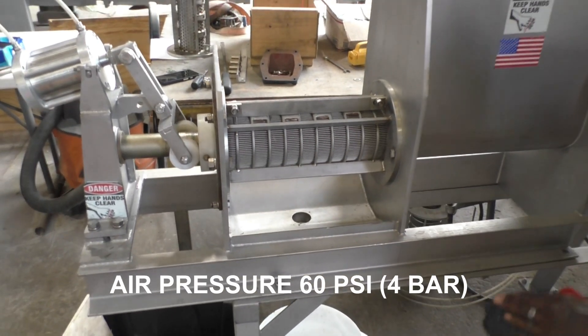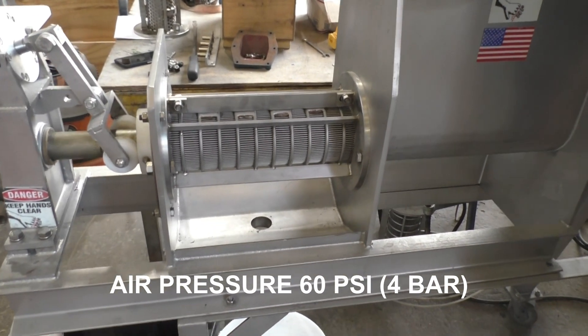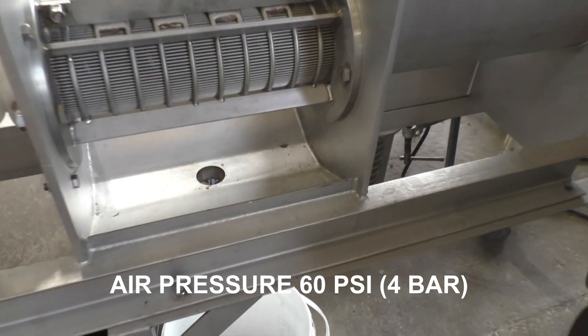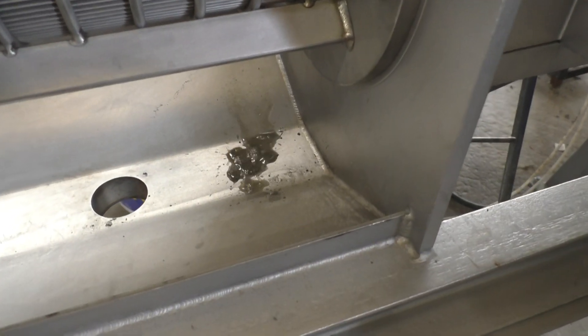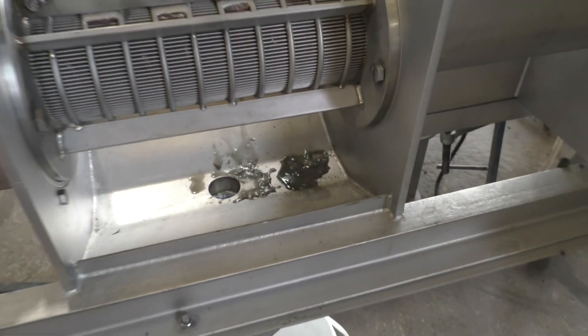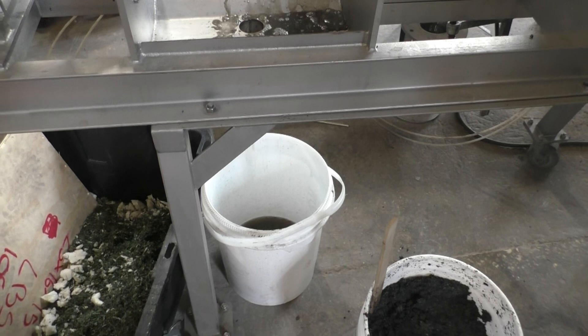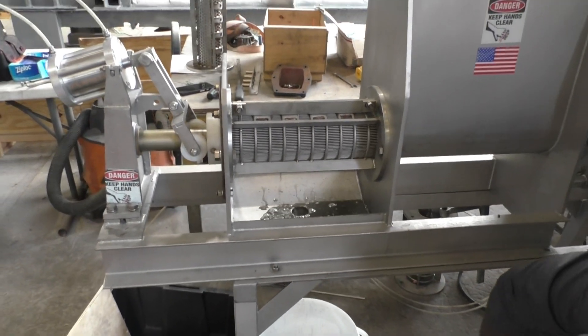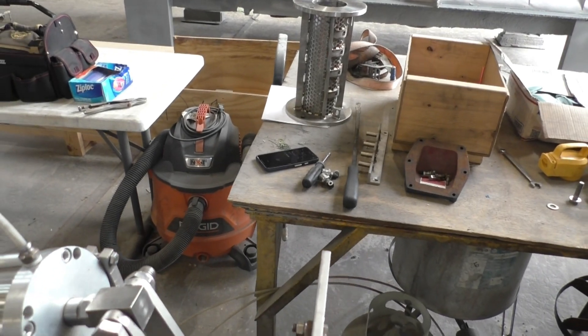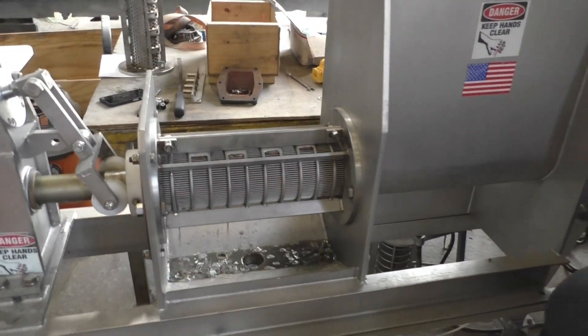Set the air pressure at 4 bar, 60 psi. That's pretty heavy for this press, but we're at maximum dewatering. Our first drops are falling through at the inlet, and there's some in the middle already — dripping the trash water down there.